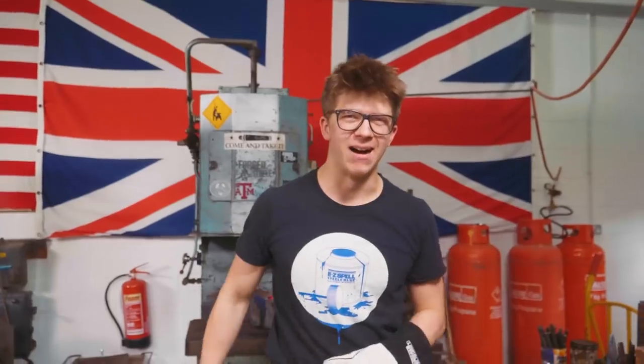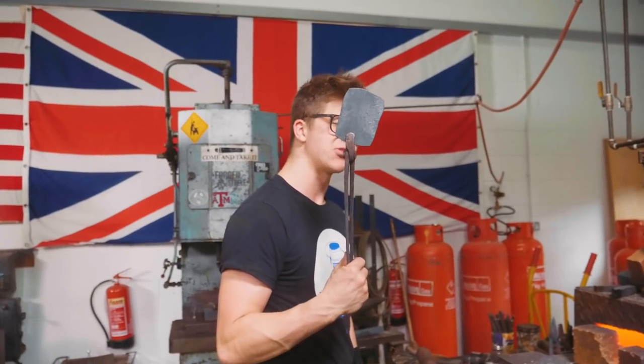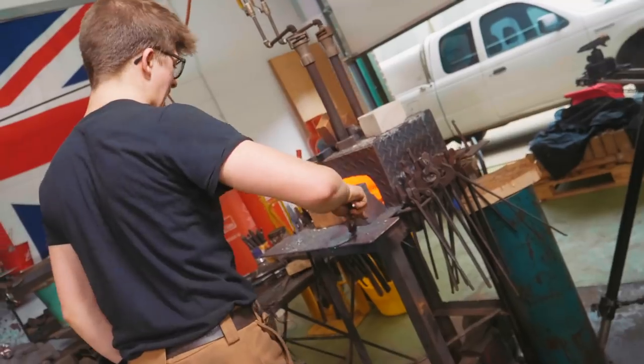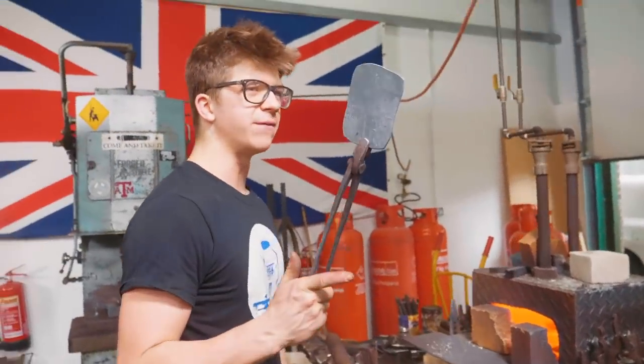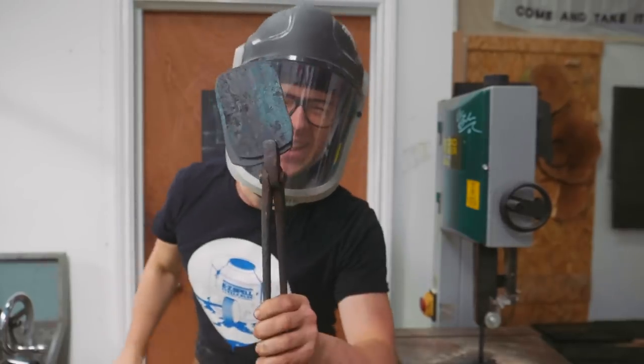Using the Pilkington power hammer, I have forged both pieces down. This here is the United States Damascus steel belt buckle to be — it is going to go in the fire. And here, the Union Jack. This thing is beefy, but thankfully there's loads of stuff I can grind off. That Union Jack belt buckle to be is now also in the fire, and I'm going to let it cool down really nice and slowly. As Jamie said, we're going to be annealing it, and then once it's nice and soft, let's do some grinding.